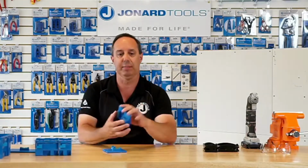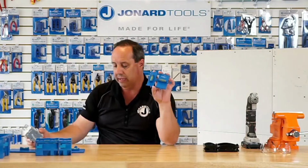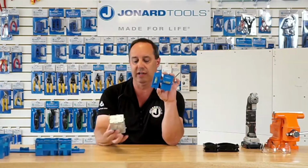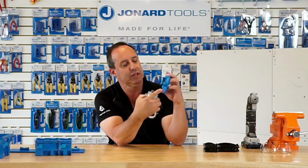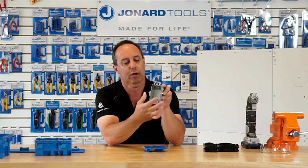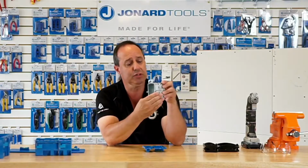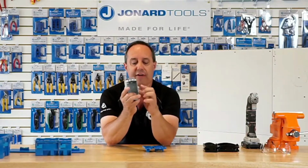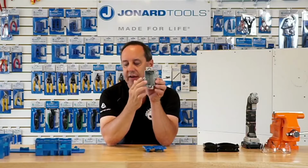We also have a WTL 32M, which is great for existing construction metal boxes, 2-inch by 3-inch in size, so a metal box like this, okay? You see it has all these edges on here, and that's to help you cut out for your wall plate screw. This box is gangable, so it has a screw over here, allows you to notch out for that. This one also has ears on the side and allows you to notch out for that.